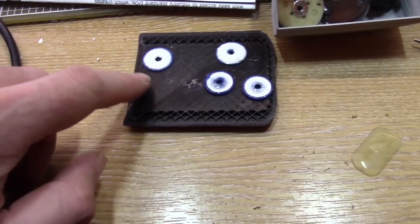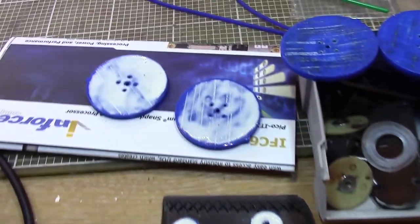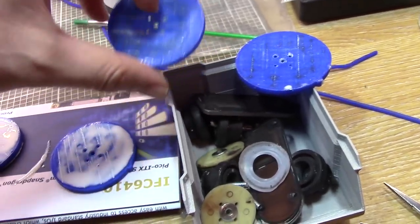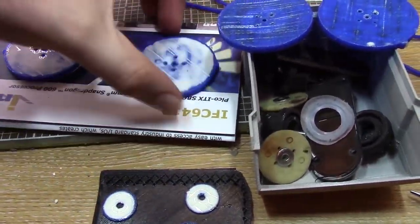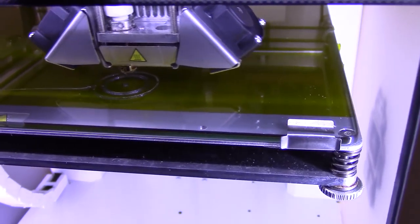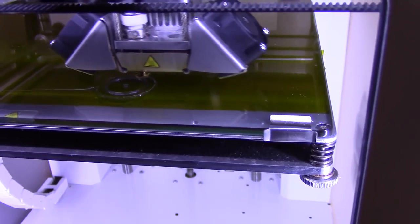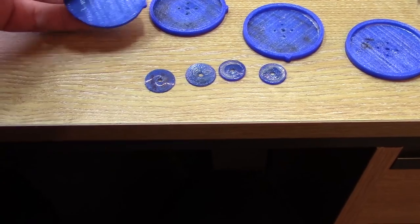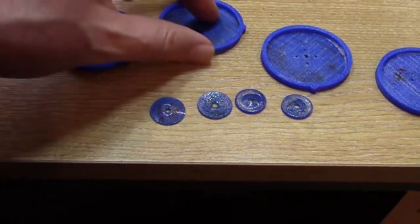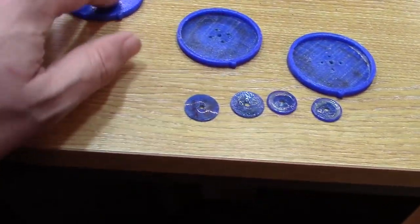The printer is busy at the moment, but I have covered those four flap disc valves and given them a good covering in latex — these ones on both sides as well. These are the 1.4mm that came out first. They should be dry in a few hours and we'll see if we get any more luck. These parts have had a few hours to dry now and they're covered with a layer of latex — it's gone see-through. You can just see one is peeling a little bit at the edge, but I covered them both sides. I did the 1.6mm discs as well, which I thought were a bit too stiff, as a spare. Now they're totally non-porous.